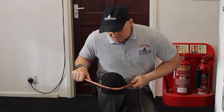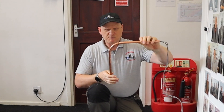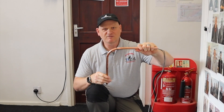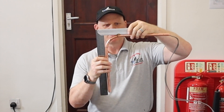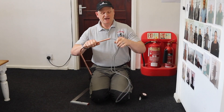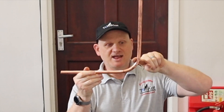You need a set square for doing this as well, to know when you've bent it round. I've actually overbent it, because if we don't overbend it we won't get the spring out. So that's my 90 degree — let's get a set square and find out. You can see it's just slightly over. What we've got to do now is just put it on the floor and gently push away. We can now hopefully pull the spring out incredibly easily. And we've got a perfect 90 degree bend, bent within our radius marks.